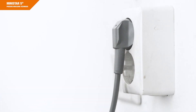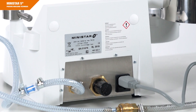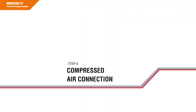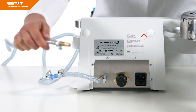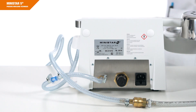The MINISTAR-S is connected to the existing power supply by connecting the included power cable to the power socket on the back of the device. With the 230 volt version, there are two fuses in the power socket which protect the electronics from surges. A 20 bar air hose with filter element is fixedly connected with the device and should not be replaced. Connect the MINISTAR-S and the corresponding air hose to your compressed air network, optionally by means of the quick coupling or by screw connection.